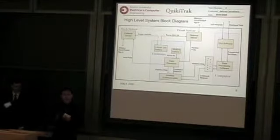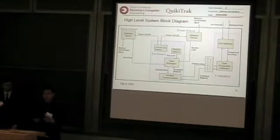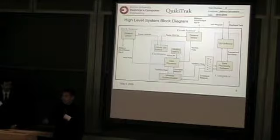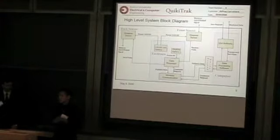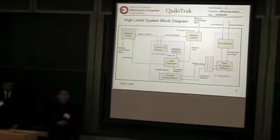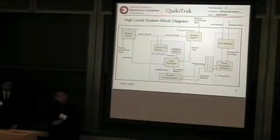Like Shawn said, there's a 7-meter drafting zone. And so when a bike enters this drafting zone, this sensor is going to pick up an ID from a different bike. It's going to store it into the data processor and then start a timer. And it's going to record the starting time and ending time of the draft violation. After the race, the user can then pick up all this information wirelessly back to the computer and then process and sort this.